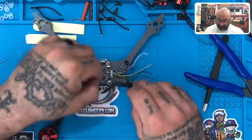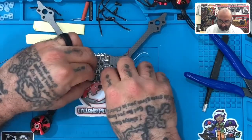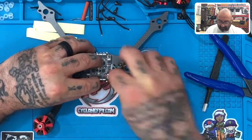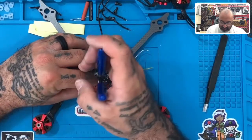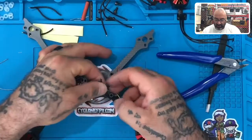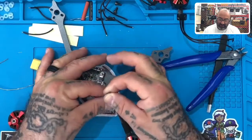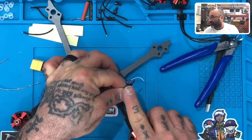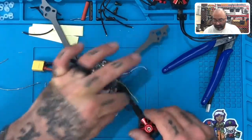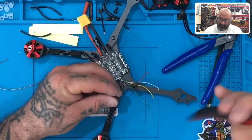And if you wanted to do it just based on 5 millimeters and extra length, you could do that too. I'm just doing this to kind of show some of the guys that wanted to see how I measure if I'm going outside, so I told them I'd do this, and then you just bring it around and you cut this one. All right, and now if you hold these up, you should have kind of the same pattern we had on the back motor, where each one is about, well, actually this one's not going to be as long because it's at an angle, but if you hold it up here, you're going to see that they're about 5 millimeters in length difference, or very close to it. Now what we're going to do is follow the same thing. We're going to strip these and tin them. Let's go ahead and do that.